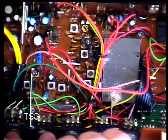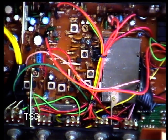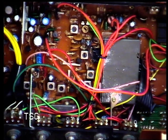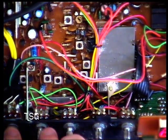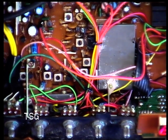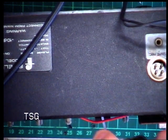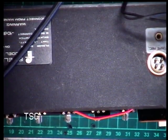Right, switch back on. We still have transmit. And we now have audio. So, I haven't got the speaker connected, so I will just plug the instrument speakers in, because there should be a jack socket at the back for that, unless that's gone AWOL as well. There we are, extension speaker. And those controls could do with a quick clean. At least these are full-size controls, so you can actually get the service oil spout into there properly and not hoping to just get through an odd rivet. Oh, that's much better.